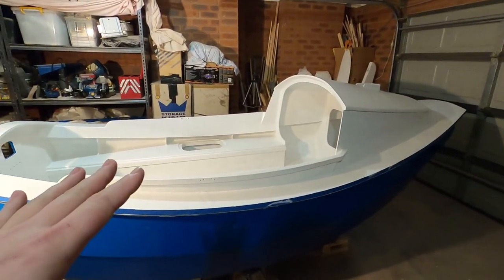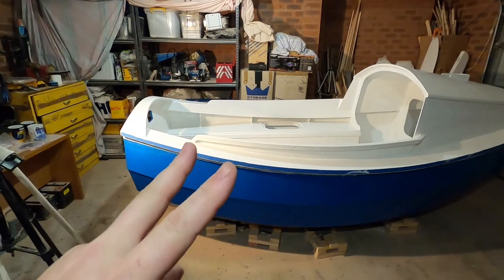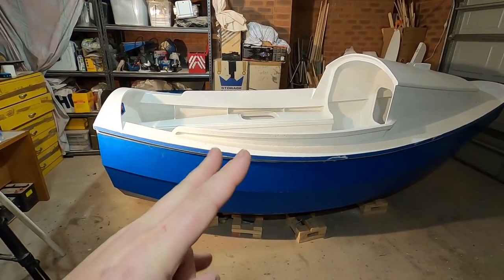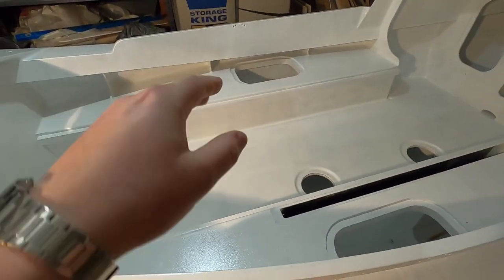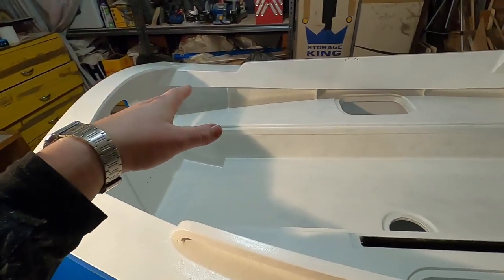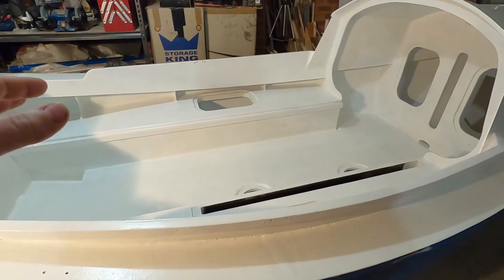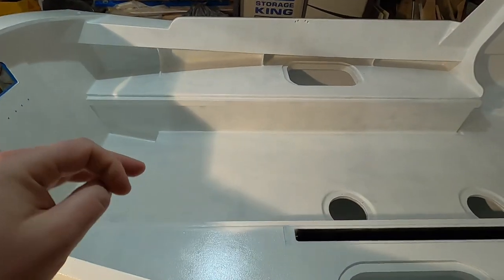I've got the actual paint over there somewhere. I'll put the first coat on tomorrow — two coats of primer, two coats of topcoat. After I've put the first coat of paint on the cockpit sole and the side deck — basically places where you're going to stand — I'll gently sprinkle some sand on it, let it dry, sweep off the excess, vacuum it up, and then the final coat will go over that to create a nice non-slip surface. I'm just super excited — it's really all coming together. Three years of my life. Anyway, it's time for dinner. Peace.